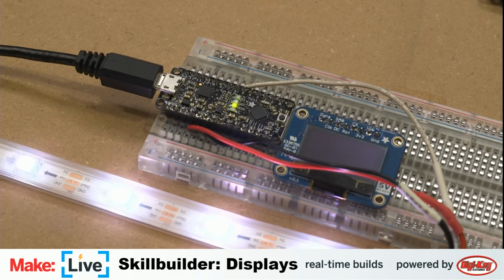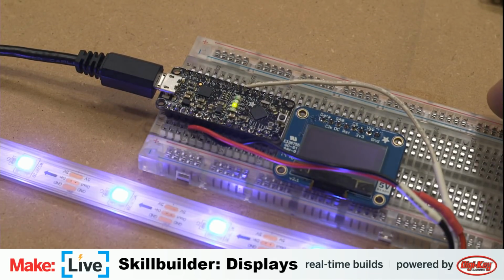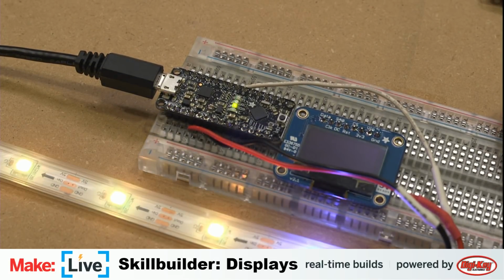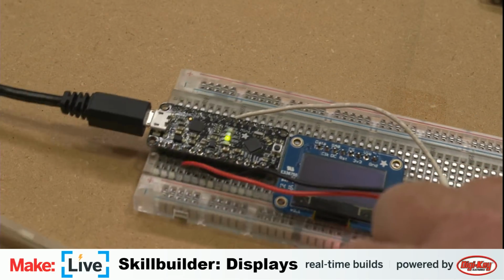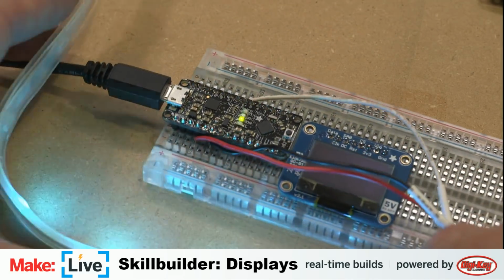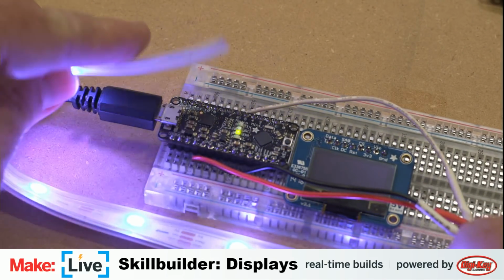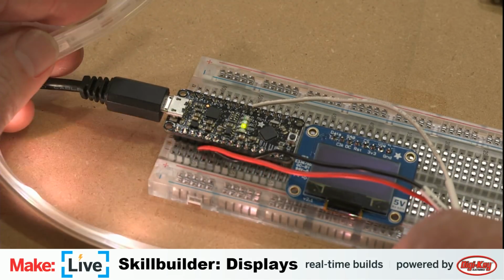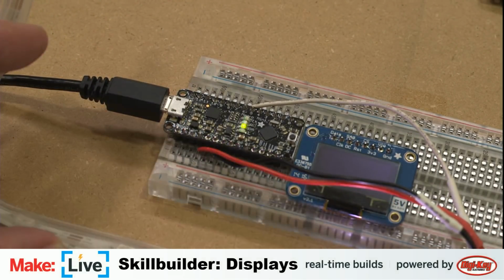And do you want to tell them what pins you connected to on the Metro? On the Metro, you can connect it to any pin here. I can even demonstrate that in a moment. Right now it's connected to pin 6, which was just based off of pretty much anything you get when you download a set of libraries to help you do your programming for this stuff. You get a couple of examples, and the example in the Arduino library for NeoPixels from Adafruit just elects for pin 6, so I just opted to use that one. But anyhow, let's take a look at this code here.